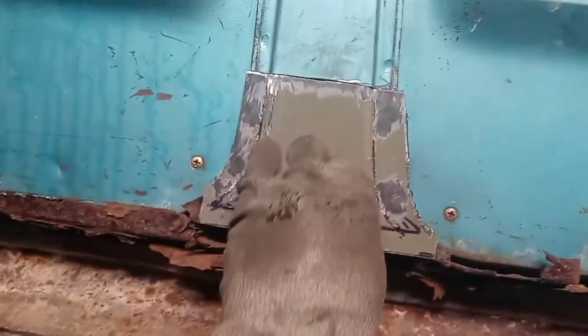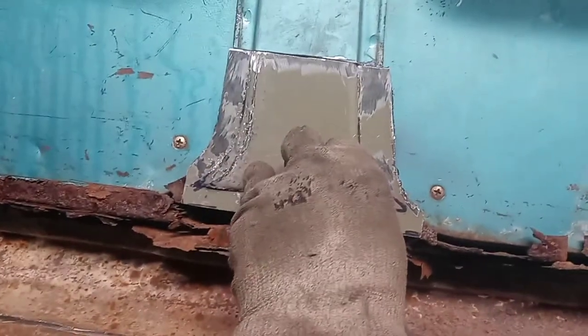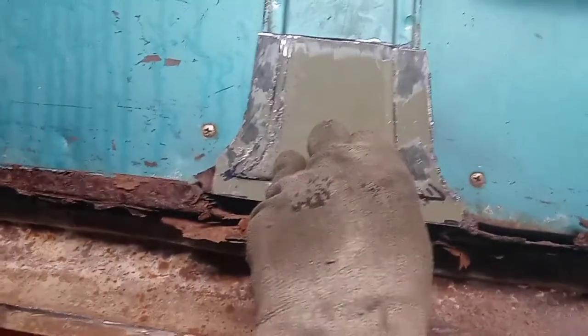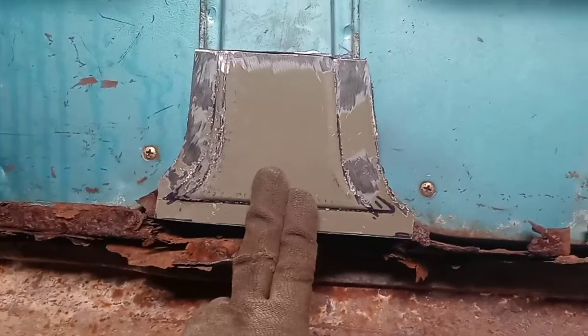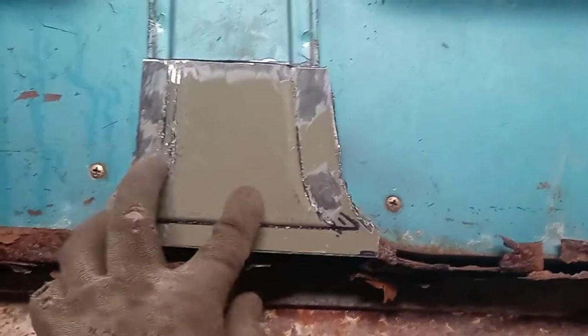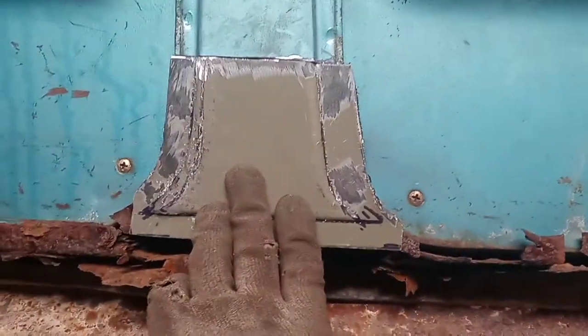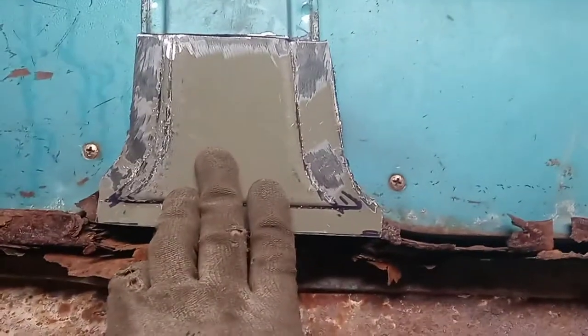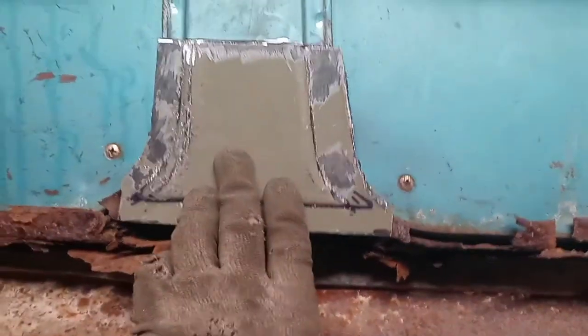So while these edges are a bit choppy, I really need probably some smooth jaws, maybe with a nice rounded edge on them for that vise, and a wider flange hammering tool. Overall I'm still pretty happy with that — it's going to be better than what was there, and it gives us everything that we need to finish the B pillar.